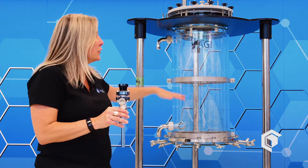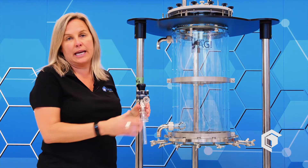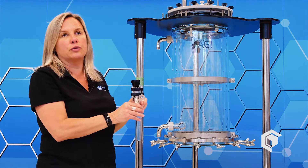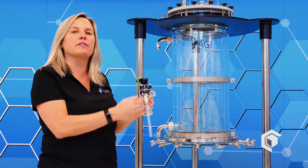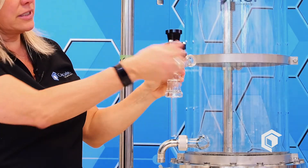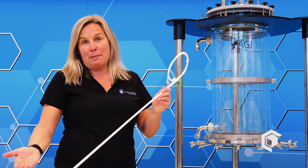On this filter reactor you also have a front large fill port if you don't want to use a pump — you can do pouring or some other method, which is just another option for filling the reactor. This is the thermocouple, or temperature probe, that goes inside the reactor and allows you to execute precise temperature control of your reactions.